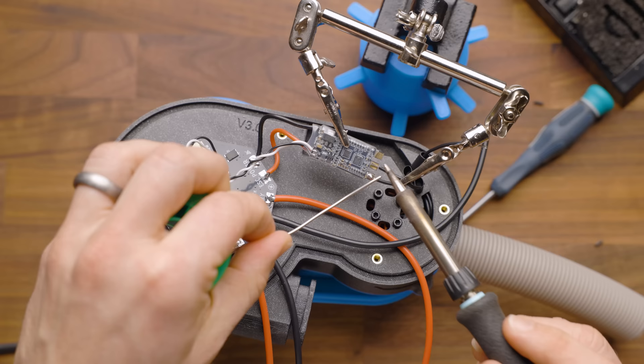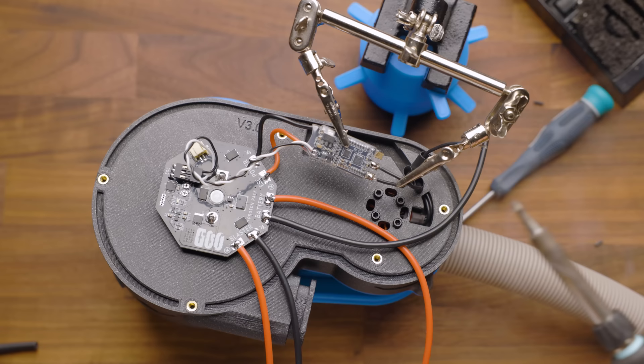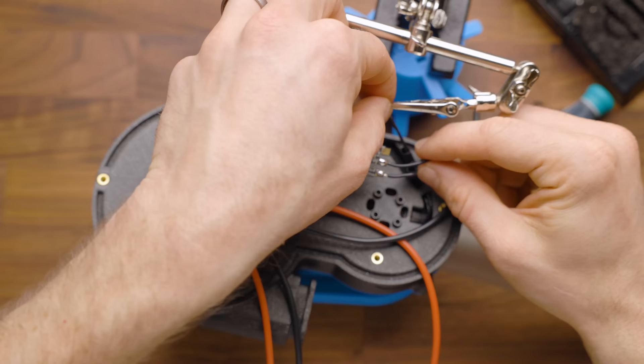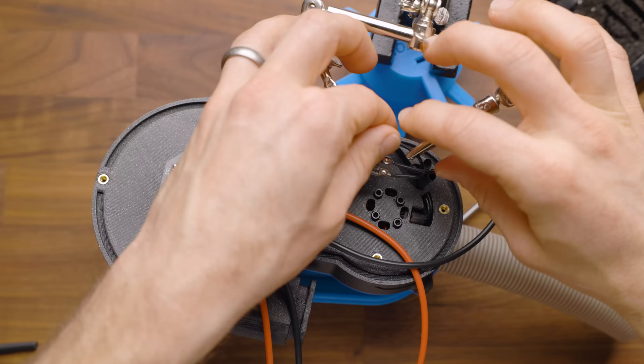After that's cooled, I give them a nice little tug — especially on these because there's a lot of copper — to make sure they don't look like they're going anywhere. Then we can unstrap that and go ahead and push this heat shrink up here, which will make it look nice and clean. From there, we can actually go ahead and tuck this whole speed control down under inside there, and then tuck the wires down in with it so it should sit like that when it's done.